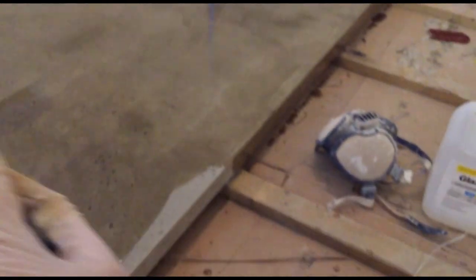I'm going around the whole surface with a notched spreader — the type usually used to put tile adhesive down. I spread the two batches together to make sure they were mixed properly, then pushed with the spreader all the way up to the edge, letting it overflow over the edge. Then I'm using a brush along the edge — what that does is allow all the excess from the top to drip over the edge and give it a really uniform edge, just as flat as the top. After about a couple of hours of this setting, I'll come in with a sharp straight edge and scrape all the drips off the bottom.